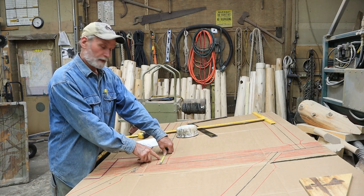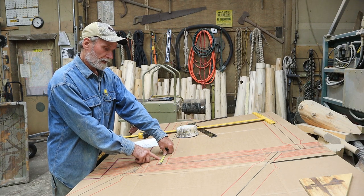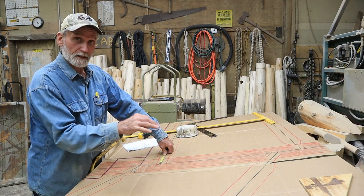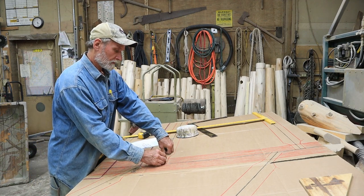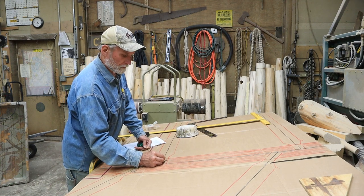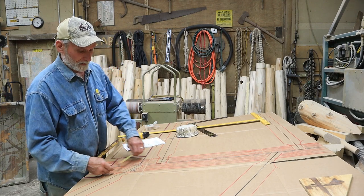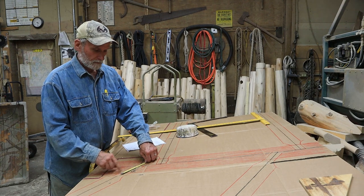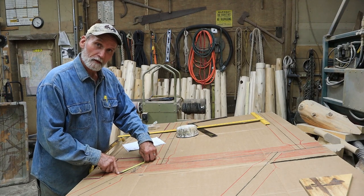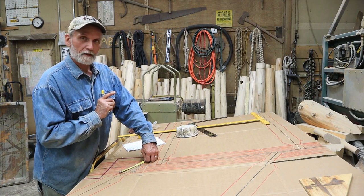Anyhow, from here, from the middle coming out, we got 3 3/8, 3 1/2, basically. So we can be safe with going as far as pressing in there and stuff. We can go 3 inches long on the tenon there. Okay. 3 inches for the tenon length on this one, but for this one, since it's at the angle, to get to the same spot, it's 4 3/4.